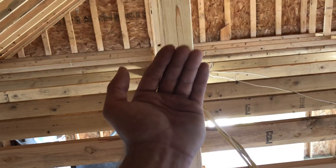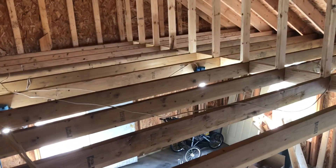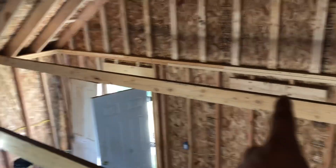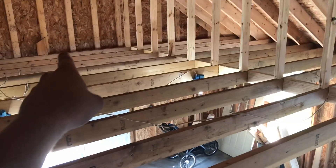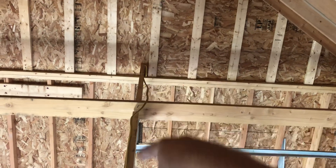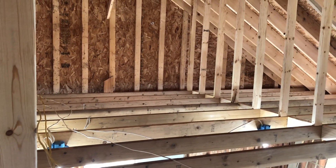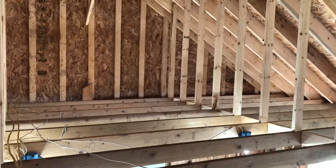It should keep our end walls from doing anything. Right now that end wall is a little bit out of plumb, and this one is pretty much still plumb. But when we get all our bridging cut and get our strong backs in, we'll be able to throw a ratchet strap literally from one wall to the other wall — that's where we have a two-by-six mounted there and another two-by-six mounted there. We'll use that to pull the end walls plumb, because the old stuff that was holding everything together had two rows already pulled. The end walls are loose right now, so once we get our strong backs put back in, that'll keep our end walls nice and tight, and the bridging will help keep everything nice and tight. The whole system should be really nice.